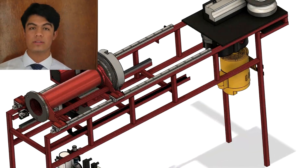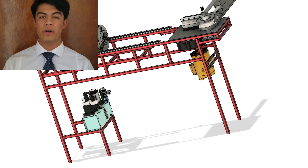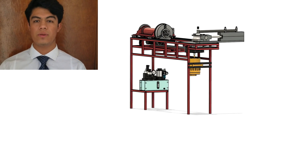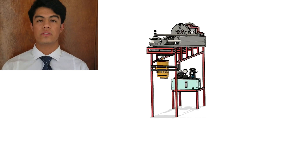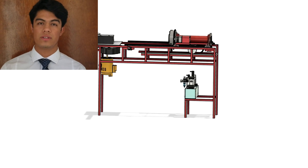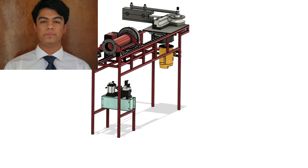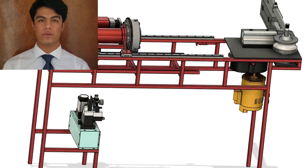A copper-coated electrode will be used. The remaining parts, as well as the tool holders, motor sensors, and the parts that can be disassembled, will be attached to the structure using screws for future replacements in case something fails. The framework will be polished to remove welding residues and spray-painted for a clean finish.